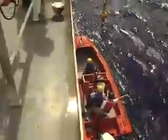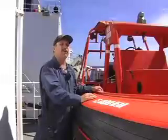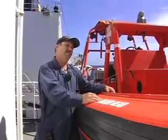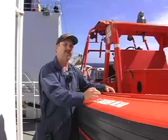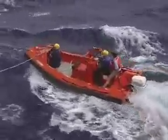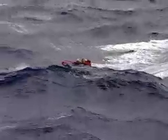They whip the boat to within about five feet of the waterline, then the boat operator gives the person on deck the signal of boom down. Once the vessel is boom down into the water, they release the boat at the releasing point. The boat is then free on its sea painter, which holds the boat in position while they get the engine started and the vessel under its own power. They release the painter and head off to the victim.